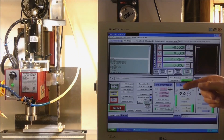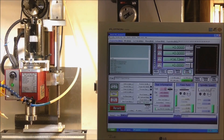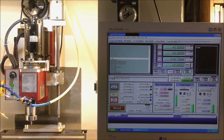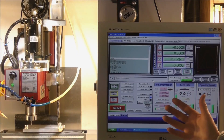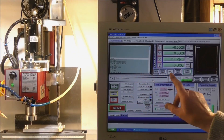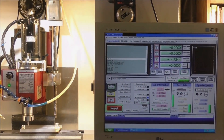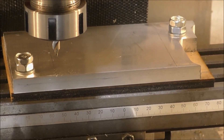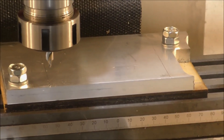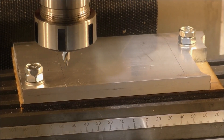Prior to putting this in, I've set all the zeros and raised the Z up off the material, ready to go. A good practice when you've put the G-code into Mach3 is to come over here and regen the toolpath — this just resets everything in Mach3. I can do this without running flood coolant so you can see what's going on. I'll start the motor up because that's separate from Mach3.